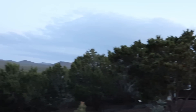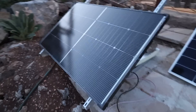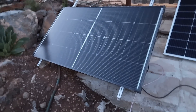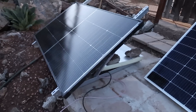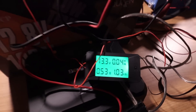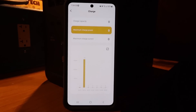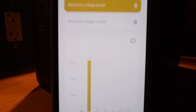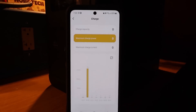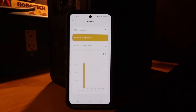Today we have 50-mile-an-hour winds and lots of cloud cover and overcast, so unfortunately the test conditions were not as good as I hoped. I have the Topcon panel on the rack weighed down with some bricks, in a better position to reflect sun off the back. Despite high wind and overcast, the results were 1.03 kilowatt-hours, or 1,030 watt-hours — pretty much the same as yesterday. Unfortunately, the Bouge RV app and controller did not record any data for today either, so we'll have to determine peak wattage separately.